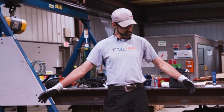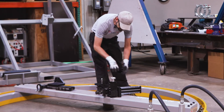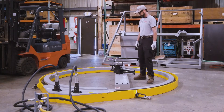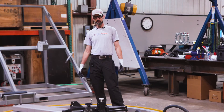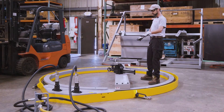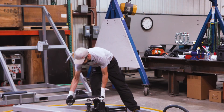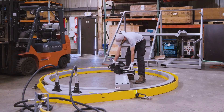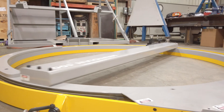This will mount to the cross beam in the normal configuration. The compound has many different angles we can put it to, and different tooling can be mounted into it, which will suffice for most applications. If a situation presents itself where this cross beam has an interference, it can be removed along with the counterweight, which will reveal some mounting holes for this back side attachment — which will still allow us to reach inside and resurface the gasket with the cross beam removed.